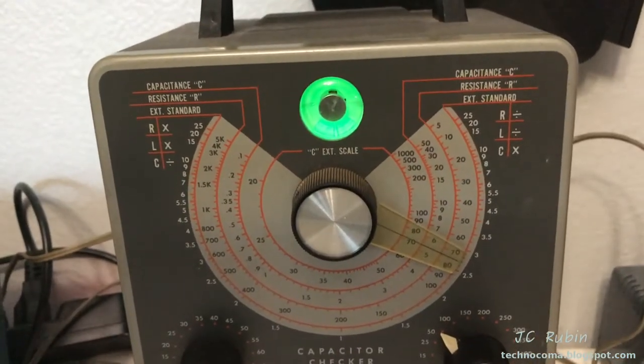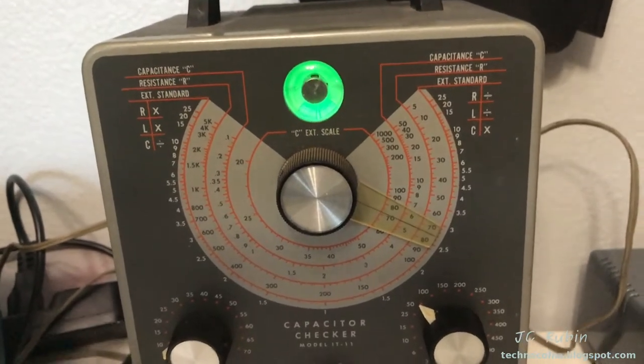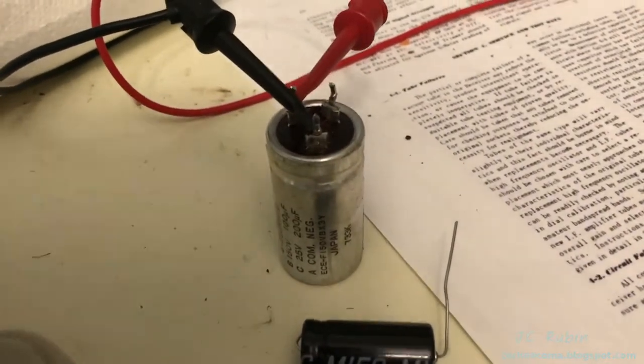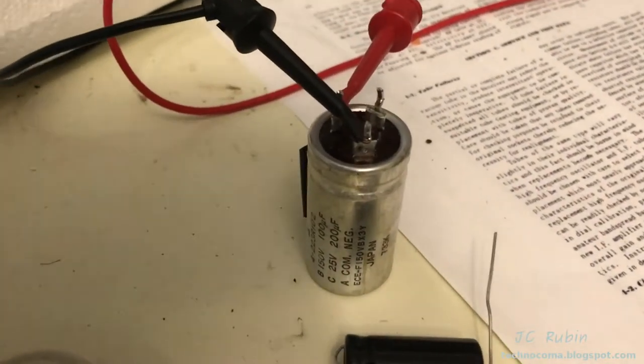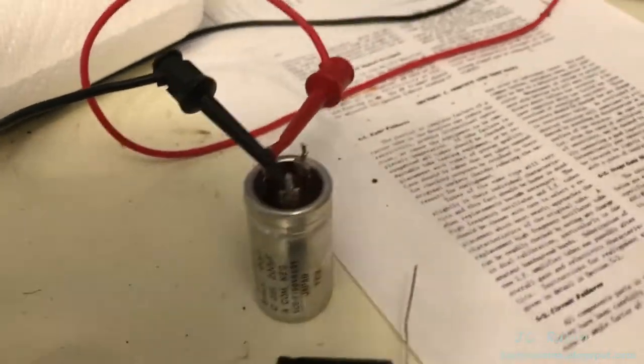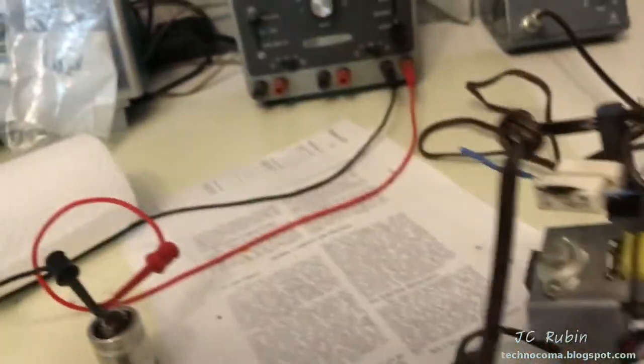This is like 8 minutes later on electrolytic, sitting at 50 volts, rated at 150. This is what you call complete trash. And this is what you would call extremely excessive leakage. And this is the 100 rated at 150 on the main power supply. That'd be enough to take down this radio and cause all sorts of terrible problems.